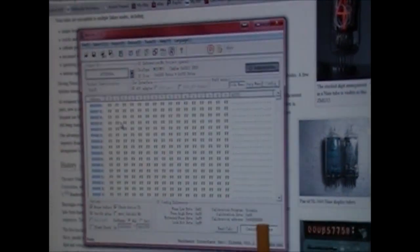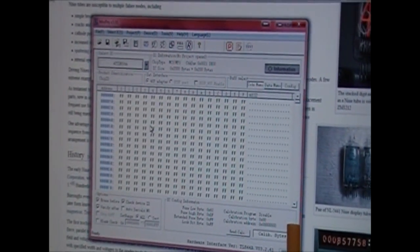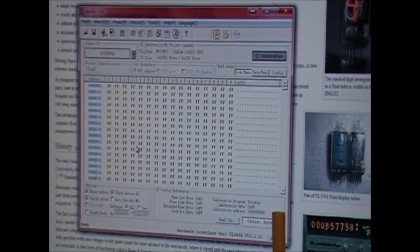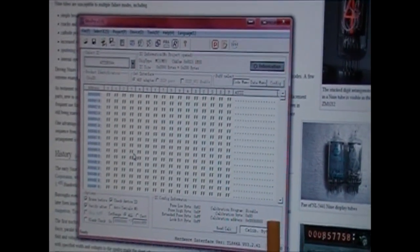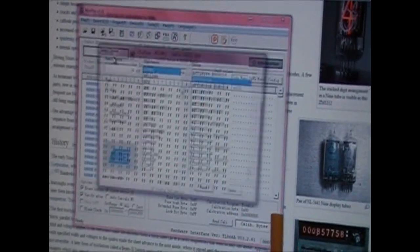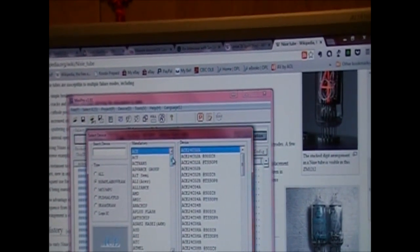There's actually a hack in the review thread on the EEV blog forum on how to hack it from a CS to an A, which I've done. You need a PIC programmer separate from this programmer, a PICkit or something similar to do it, but once you do it, it works like a charm. Anyway, so we're just going to quickly...